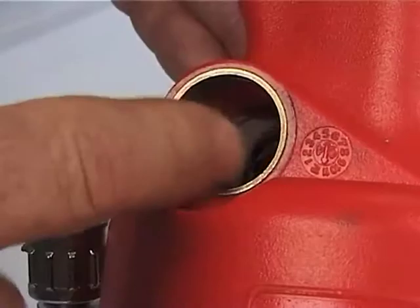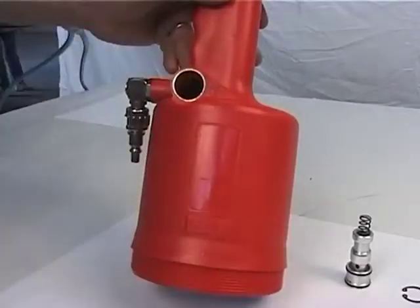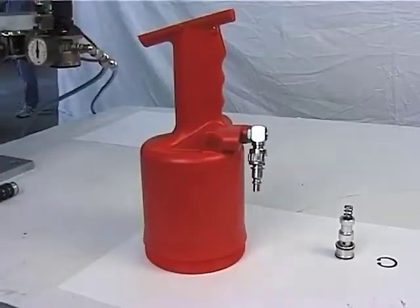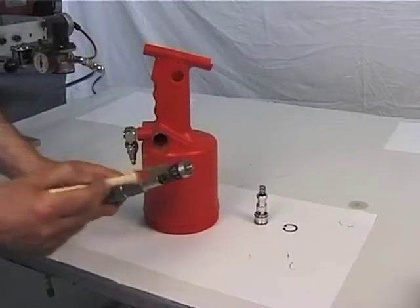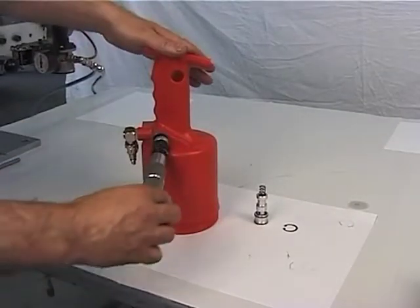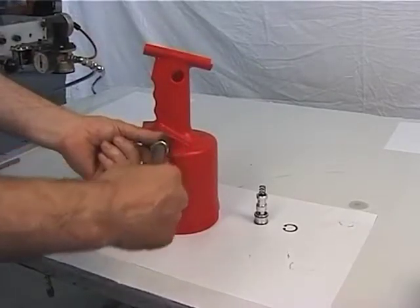Check the valve assembly housing for wear, then insert and fasten the cap, figure 51. Grease and push the valve group inside the body until end of stroke, and extract only the rear side of the special wrench so as to contain the valve components.